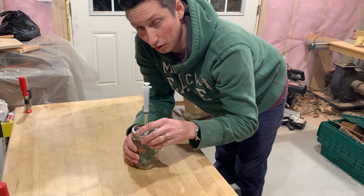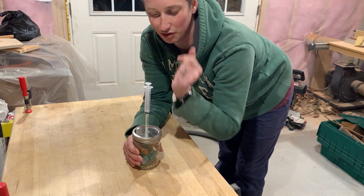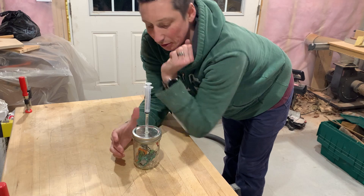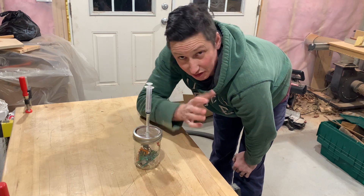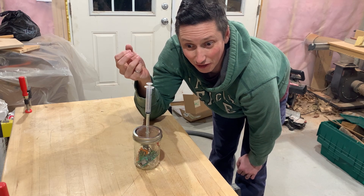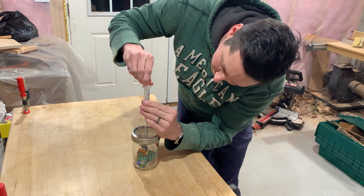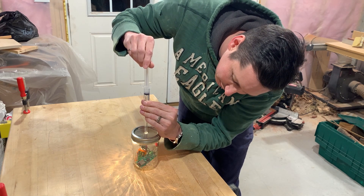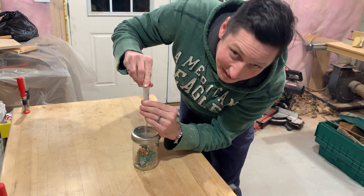Knowing that it runs off barometric pressure, I made this kind of ghetto vacuum chamber — it's a syringe from Eddie's antibiotic days, a mason jar, and some hot glue. Basically pulling the plunger all the way up simulates about a 700-foot flight — it creates a vacuum that simulates the atmosphere getting thinner as the rocket goes higher and higher. Then we're going to make sure this thing lights up twice. There's the drogue — now we're falling — and there's the main. It worked, it actually worked!